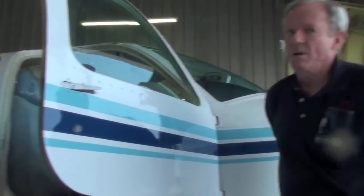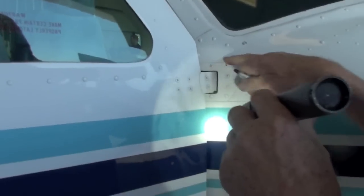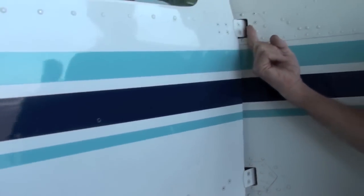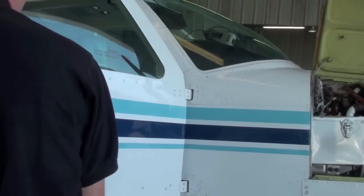The doors on Beech airplanes are a problem. It's an engineering problem. They've always had a problem and they always will. There's an aluminum box that goes right here that surrounds the door hinge on the top and the bottom. What happens is they run a steel pin through the aluminum box, up through the hinge, which is brass, and out the top of the aluminum box. Well, nobody ever lubricates it. It gets neglected at annual. So the steel pin freezes in the brass. It starts rotating in the aluminum box, and it elongates the hole and you can pick the door up and down.